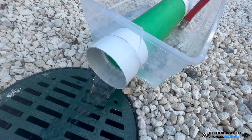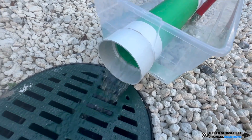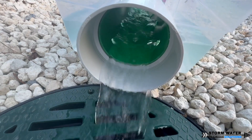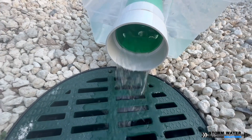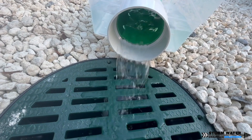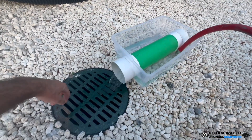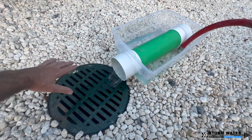The holes on the side are a little bit better because force isn't going down on them. So it is said that if you are going to use PVC for a French drain, it's best to use the one that only has holes on the side and keep the integrity and strength of the bottom of your pipe free of holes. There's a reason the manufacturers don't put holes 360 degrees around the pipe — they know it would weaken it way too much and there would be too many collapses and failures within a matter of years.